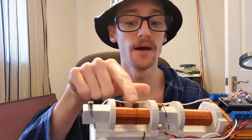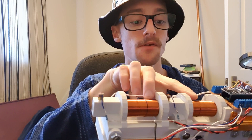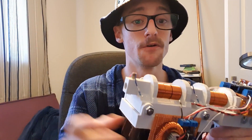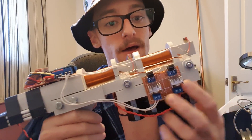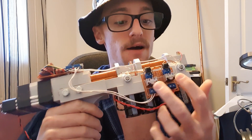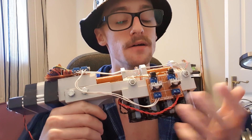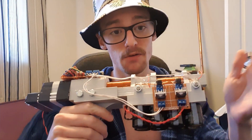What you do is put the current through these two coils. Each one of these coils is about 250 turns, and for a very brief moment they form an exceedingly powerful magnetic field. The switching is handled by these two MOSFETs — these are the two beefiest MOSFETs that I could find. They can handle a 300-amp pulse, not continuously, just a pulse.